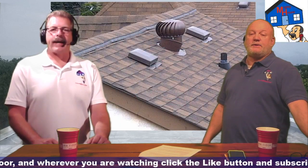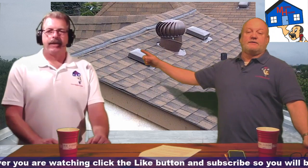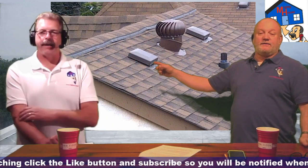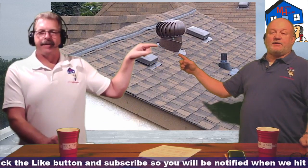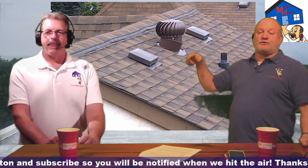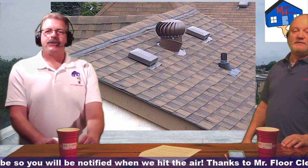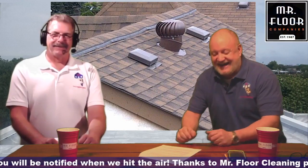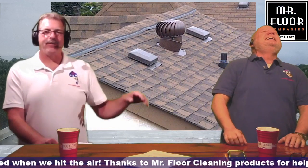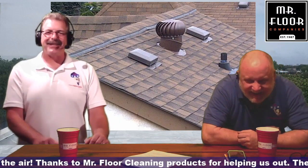This is the picture — I really love this one. There's the ridge vent right here, then you've got your regular mushroom vent here, and then you've got the turbine there. So this is all short-circuiting everything. You know what they call that? A 'circumvent' — because none of it's going to work properly. They've circumvented all the rules of venting. That is terrible.